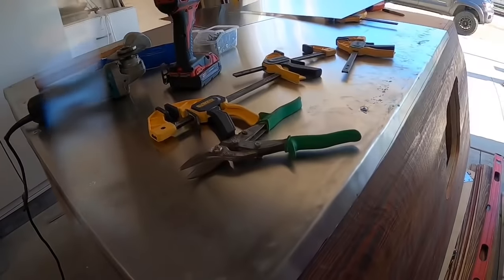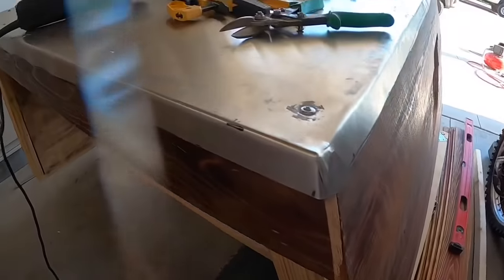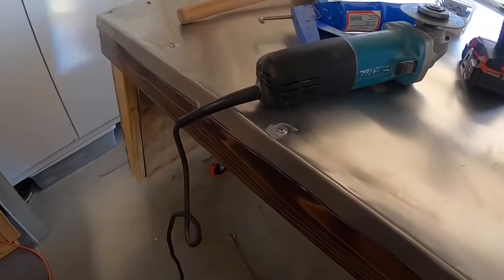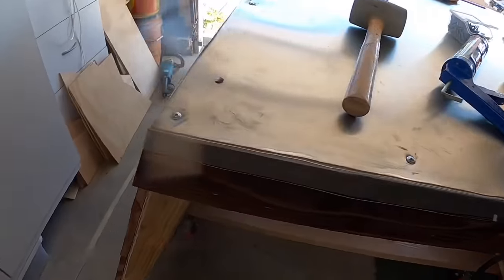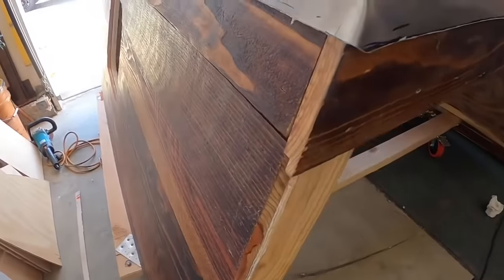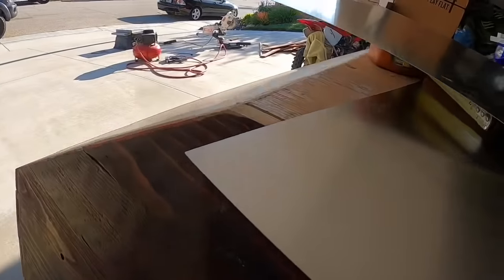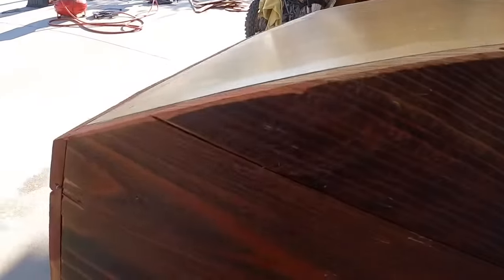This is your 0.025-inch thick aluminum, and I had wrapped that over the edge of the shell, ensuring that any water I did come across rolled off and onto the shiplap itself and not in between the wood. I also took that aluminum and wrapped it all the way down the front edge. Unfortunately, I don't have video of that.